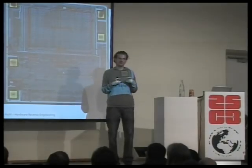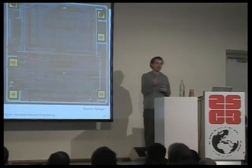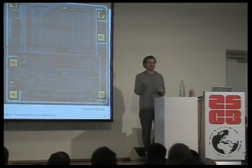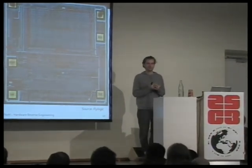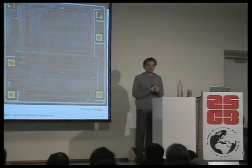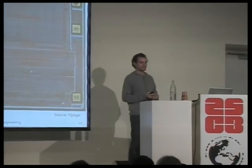I don't know how to build a solution. What I'm trying to get across, though, is that if you are building hardware and you are already using good cryptography, do not rely on the fact that your keys are securely stored. Try to store them in as few places as possible and prepare for the case where your master key gets compromised. Have good key rollover schemes. So that would be one advice.